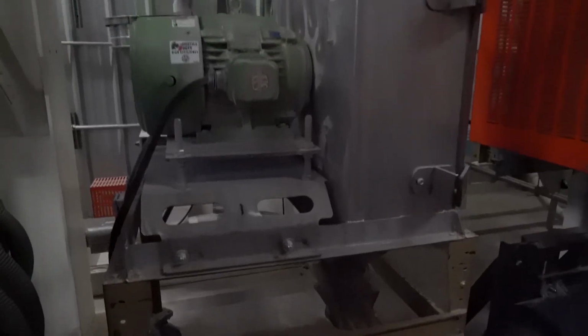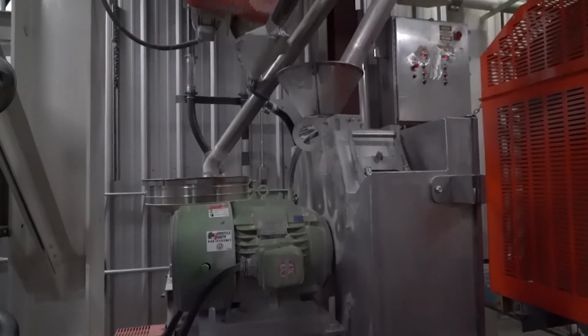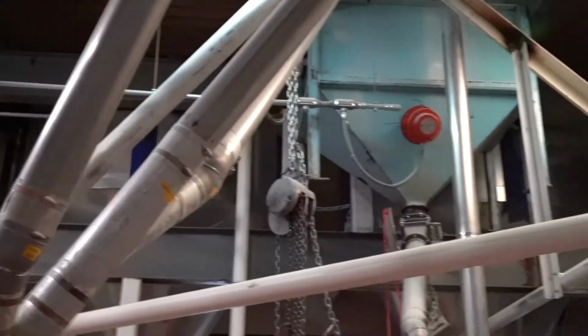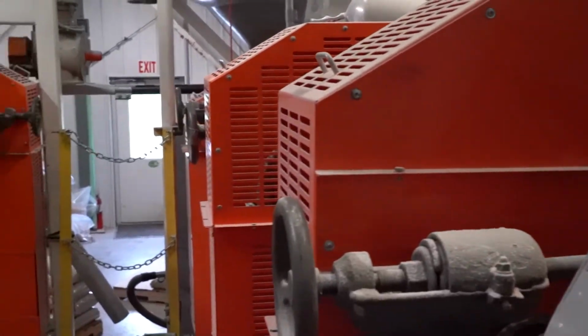And in addition to the roller mill, what other mills do you use? Oh, the hammer mill and the stone mill. One thing I think is interesting, we use pneumatic systems where we don't use bucket elevators when we're processing the flour. Everything's sucked with air through a pipe to the next station that it's going to. And people say that stone milling, oh, it's so much cooler. And we've taken, well, there's thermometers, and the hammer mill, the stone mill, and the roller mill are all about the same, within a couple of degrees.